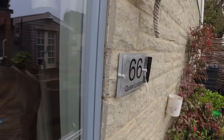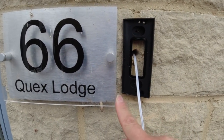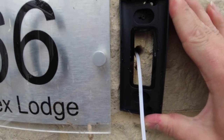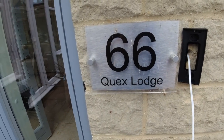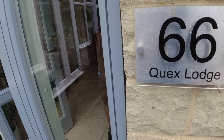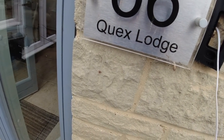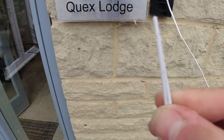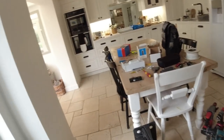I've got the angle bracket on and leveled it off against the house sign — I'm trusting the resident put it up straight. They give you some adjustment on the screws. Now I've just got to connect the positive and negative of the cable. This cable doesn't have any identity markings on it, so let me check the doorbell for polarity.